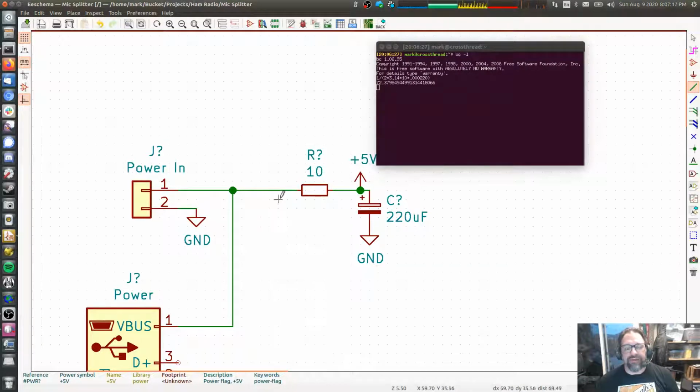of the RC value of this. The idea being that this is a capacitor to ground, that's a shunt, low pass filter. The idea being that we are going to, well, I guess technically it is a high pass filter to ground. So we are taking all of the high frequencies and shunting them to the ground. That's the idea behind having this R and that C there.